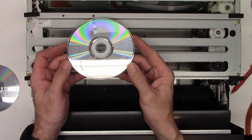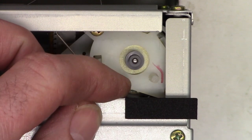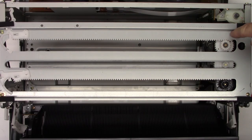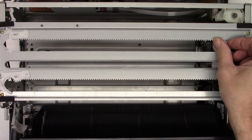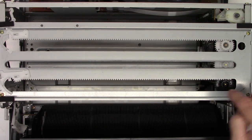Here's the other problem I see: that right there is a motor, and a motor needs a belt to operate. There's no belt on it. I suspect the belt is caught up in the gears right in here, and this is the sliding linear mechanism. I can't even move it back and forth, so let's go ahead and pull this top off.